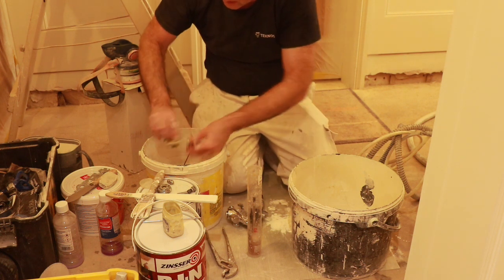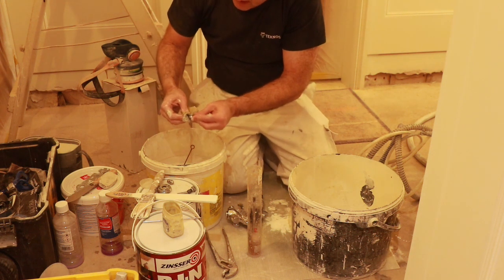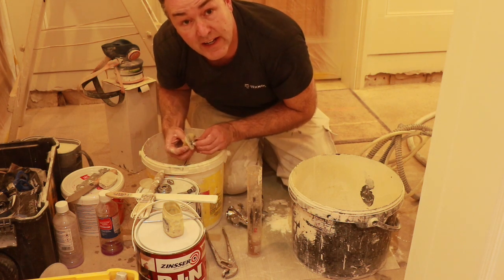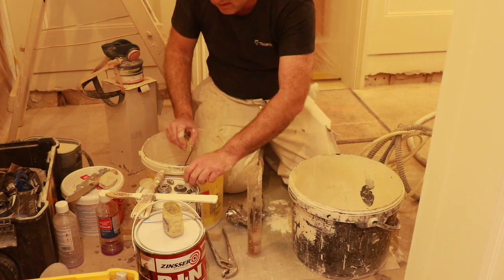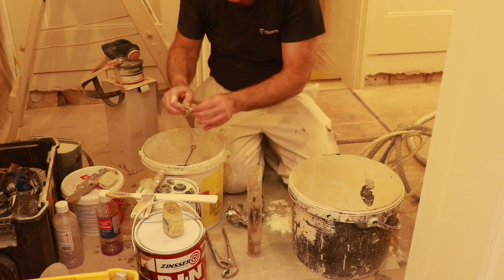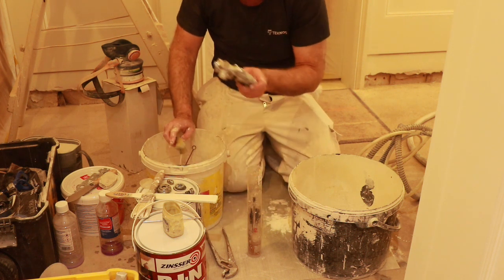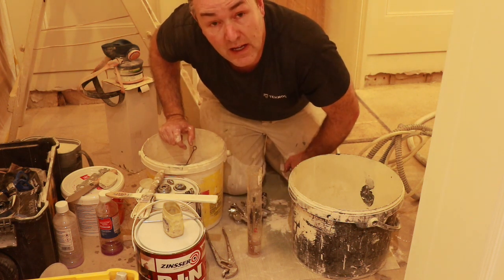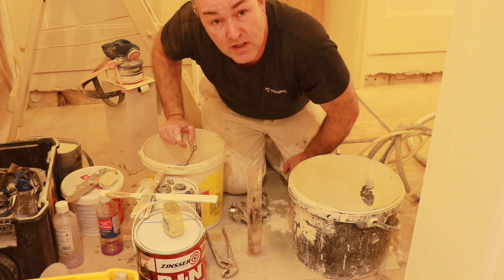Warm water gets all that off. That's all nice and clean. And then all you need to do, put some Vaseline on and just reassemble it. So that's where we are with all of this. Don't forget to put the O-rings back on and we're done and dusted. So actually, cleaning out your HVLP kit, 5-10 minutes, dead easy. It's one of the easiest ones to clean out.